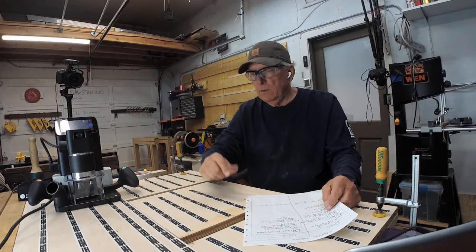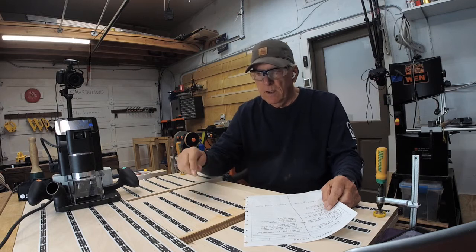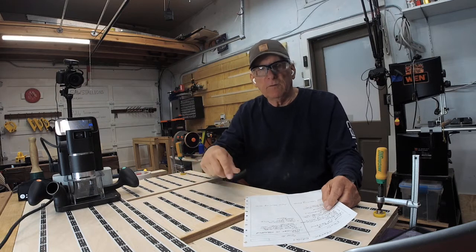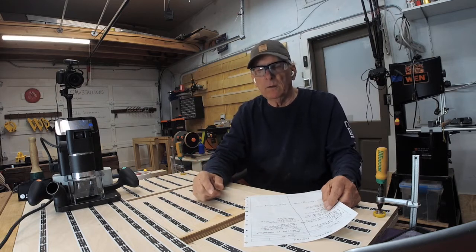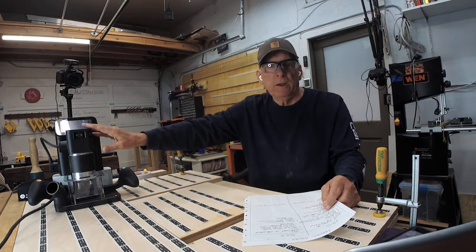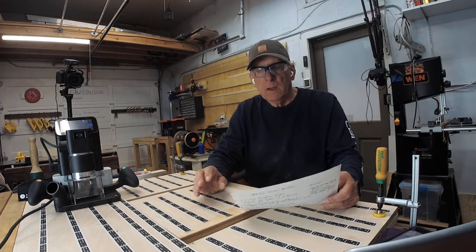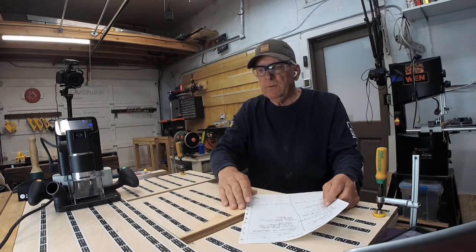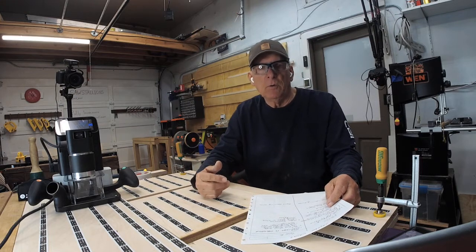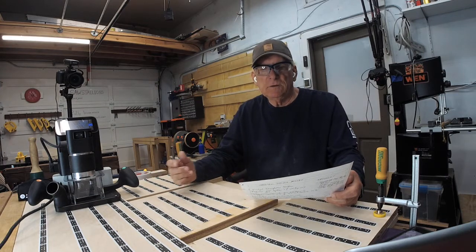When I did those 4 circles in that jig for my French cleat system back there, because it's a very small bit on it, I had to go around about 6 times, not wanting to overstress the bit. Now, you can put a bigger bit on it. It is a regular router. They call it a spindle, but it's a router. And so as I get more experience, I'll learn how deep I can go, how powerful it is for that. It is variable speed. That's an advantage.